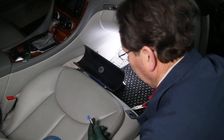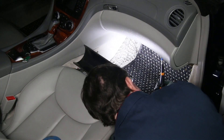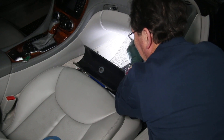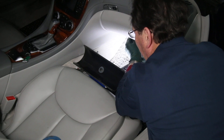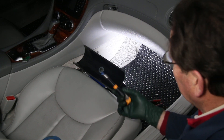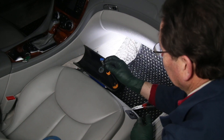So I'll get the next screw and shove it onto the masking tape — see that? Now I'm going to reach up in here and try to feel this one. And then we'll screw that one in. I'll get it about halfway in, then I'll pull it out and do the same thing. So I'll get these three screws started in half the time it would take trying to mess around with feeling them in and having them constantly falling off the screwdriver bit.